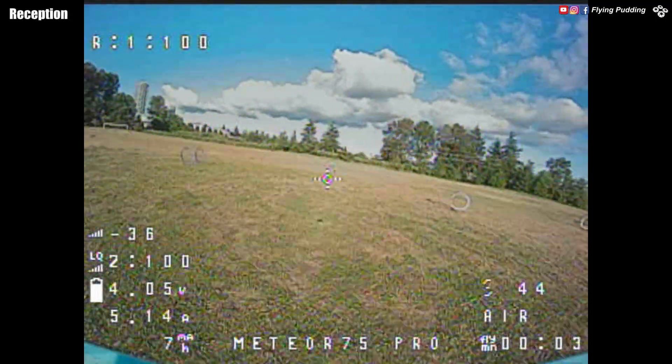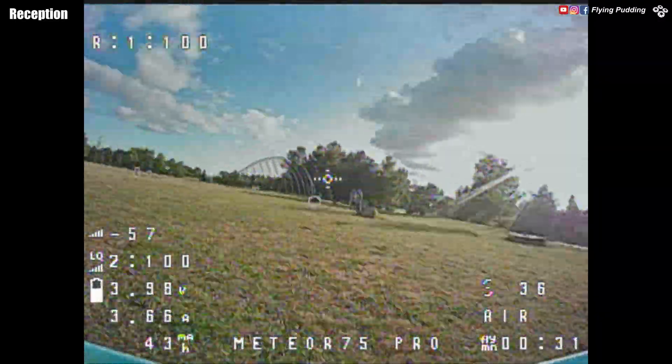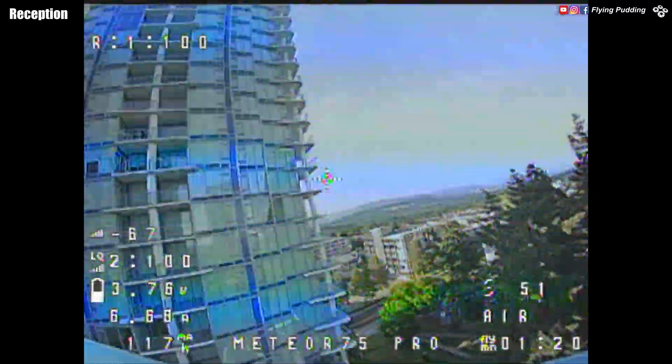We will start easy on an open field. Distance is about 130 meters with little or no obstacle. VTX output at 100 milliwatt and goggle is VR03 — both video and control links are perfect. Passing through a concrete tube about 100 meters away, there is noticeable video breakup but still manageable. Getting above tree lines, video deteriorates when vegetation breaks line of sight. Video is barely usable at 50 meters while the radio link is still solid.